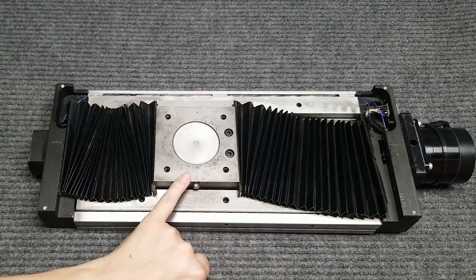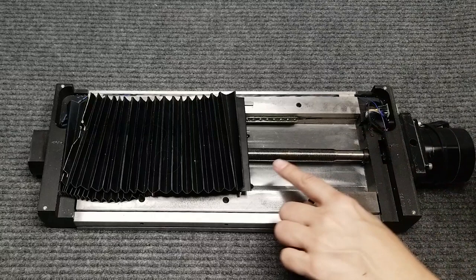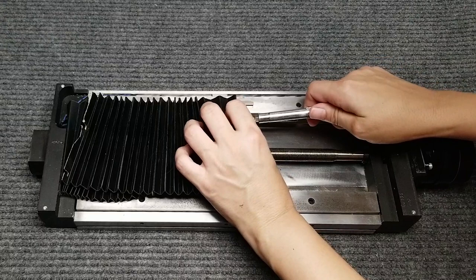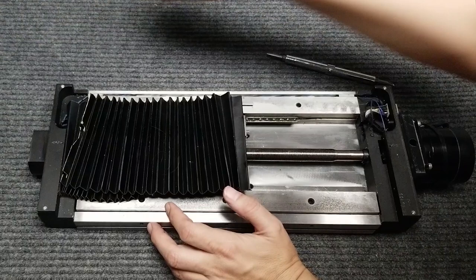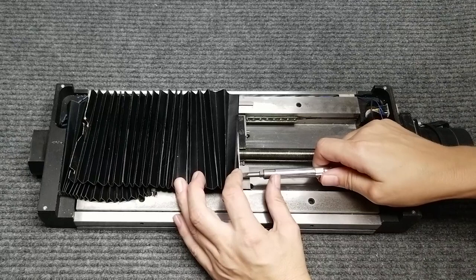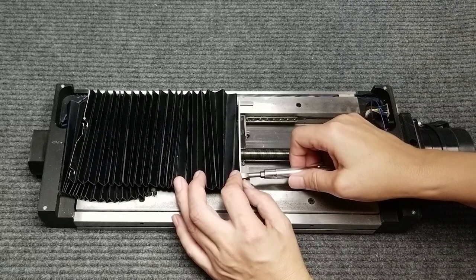With the ugly covers off, we can see the slightly less ugly axis. What they did was they took a block of tool steel - this is probably about 115 millimeters wide - and they carved out the center of it. They took a whole block of steel and just milled out the center, because apparently cost was no option. This thing has no gibs in it, no gib strips. Instead, this center block rolls on ball bearings on either side. These are little bearing race keepers - they're called separators. This block slides on bearings held by these two blocks here.